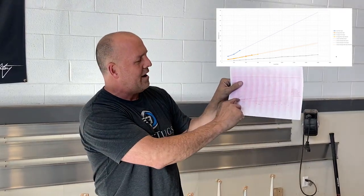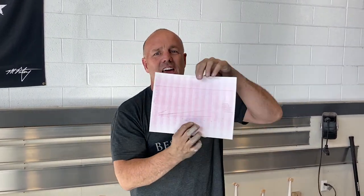There's a couple outliers, one right there, and those are when I was ratcheting. Sometimes I ratcheted just a little too far. Instead of 600 pounds, I took it to 625, but it showed every one of those outliers, and overlaid on SolidWorks, they chase each other all the way up on all three spars. So I'm blown away. I mean, technology has made designing aircraft so much better, so much safer. So good job, SolidWorks. I am even more a fan than I already was.